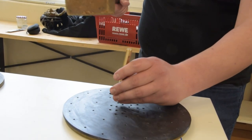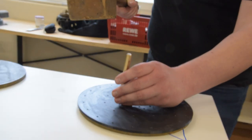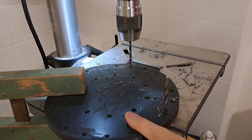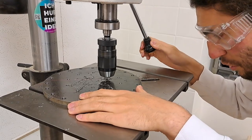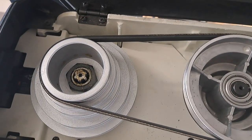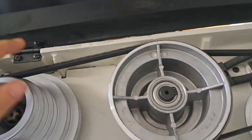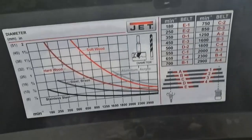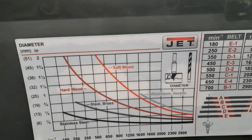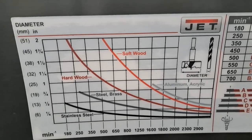We used a guide plate which would tell us exactly where to drill — basically just a plate with a bunch of little holes in it. All of these little holes would tell us where to use a center punch and put a little hole into the injector plate where we wanted the big holes to go. Then it was just a matter of using the drill press to follow the guide given by all of our center punches. You can see that the drill press speed is controlled by gears — a bit of an old school method. All we have to do is adjust the belts on the gears to adjust the speed, and we have a chart that tells us which settings correspond to which speeds and how fast to spin the drill for different types of materials and different sizes of drill bit.